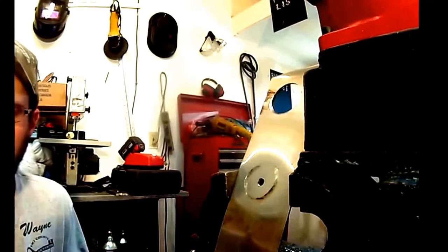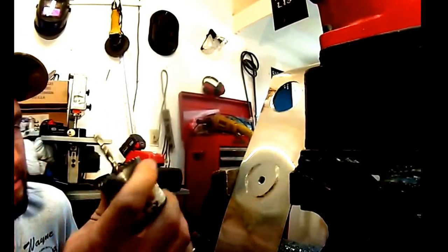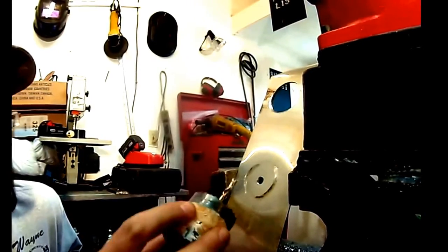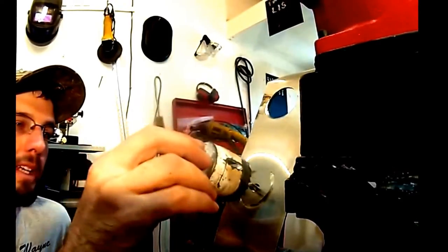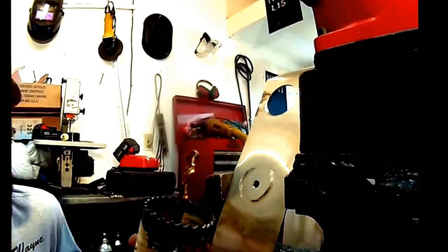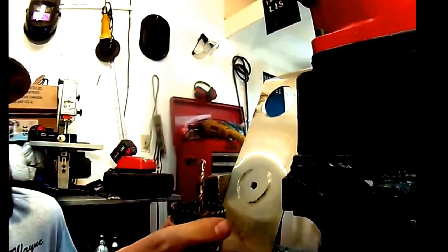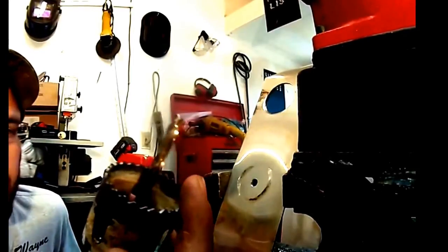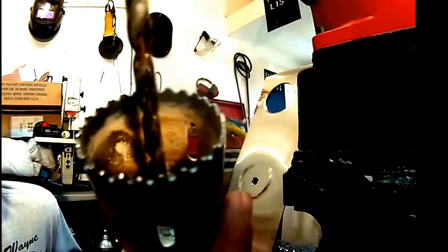So you need to drill a large hole in stainless steel. You have a problem because if you use a conventional hole saw bit like this, this is exactly what's going to happen. Number one, I had to actually use a carbide bit to go ahead and get that first pilot hole drilled out. And then to prove that this system right here did not work — that the actual hole saw itself did not work — that's what happened. You know this is stainless steel because it stopped the drill bit, number one. And two, you can see how it just flattened all these teeth way down — they're just completely flattened out.